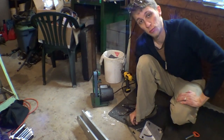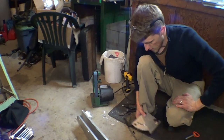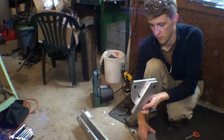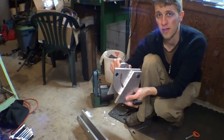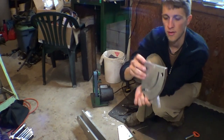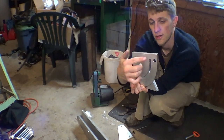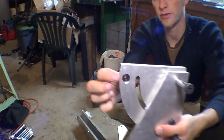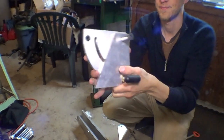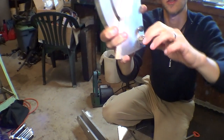Now I sort of liberally borrowed this idea from Brian Feldholter's Uber grinder, but basically this is simply part of the mechanism: 2 plates like that, this one and the one in front, and then this tilting plate here with the slot in it, and I've pushed in 2 drill bushings, one there and one down at the bottom. This handle is a spring-loaded plunger.